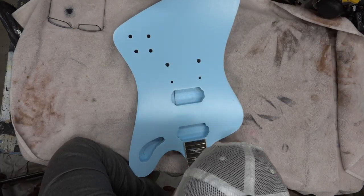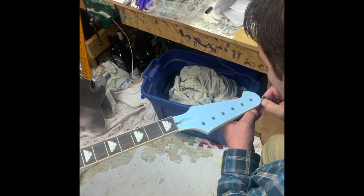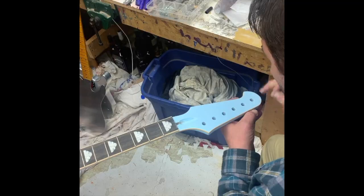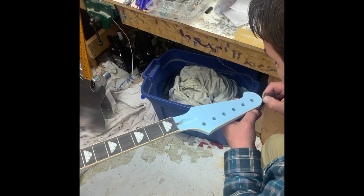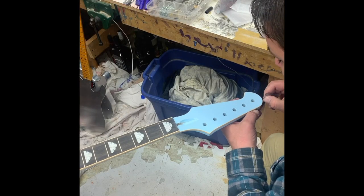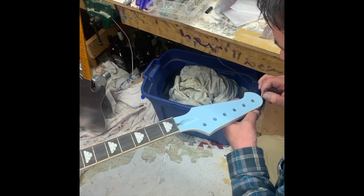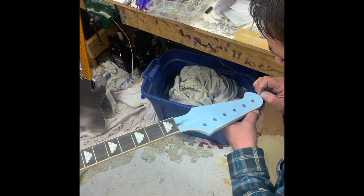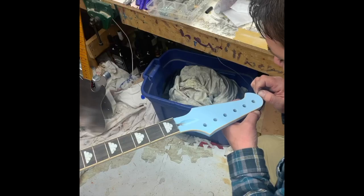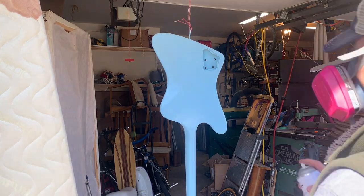A lot of back and forth. If you follow my other videos, you know we had actually tried to stain the headstock with that piece of ash, and it just didn't look right — it wasn't a perfect match. So we went ahead and grain filled and painted over that ash. One day when someone else gets this guitar and sands back the headstock, they'll find a nice piece of ash veneer. Scraping very slowly to keep that binding right.